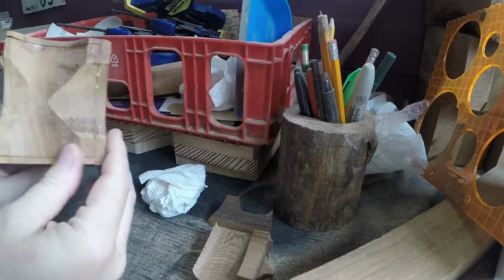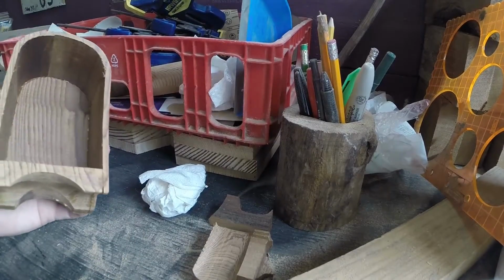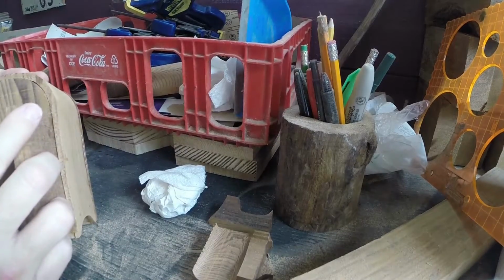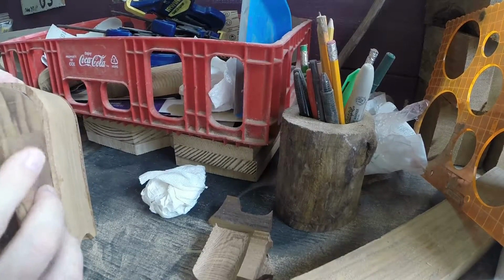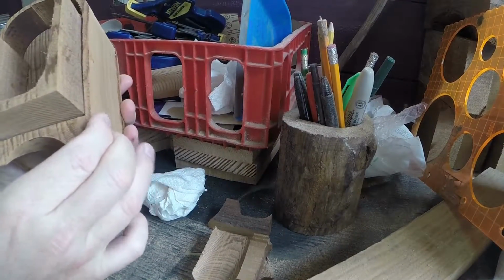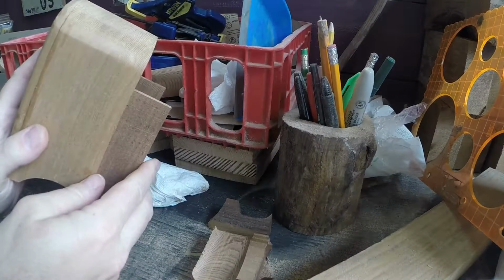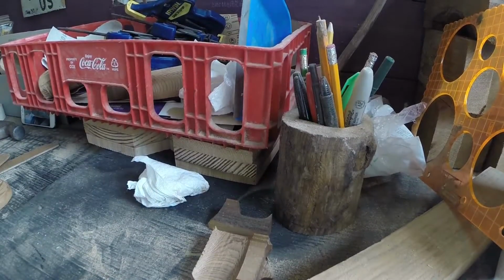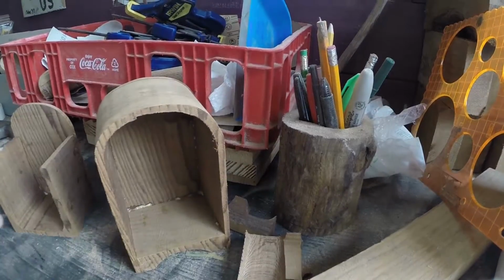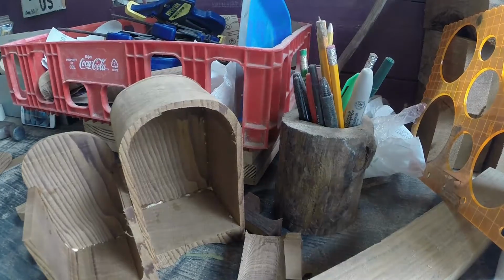So you see our box is lined back up. Looks pretty good. The drawer would be very tight right now. It's actually a lip right there where it's catching on, but see, the drawer is very tight now. That's because we've compressed it this way, so it's tight. So we're gonna have to sand this drawer in order to get it to loosen up. So we've got a little bit of sanding to do. We sand this, and we'll sand this, and we'll sand the front. Let's go back over to the sander.